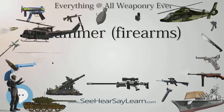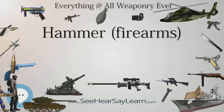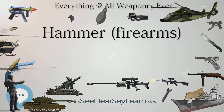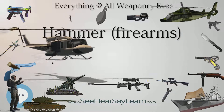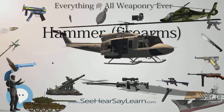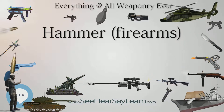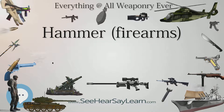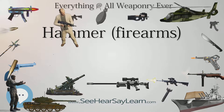The match lock system, introduced in the early 1400s, acted as an arm known as a serpentine that held the lit slow match. When the trigger was pulled, the arm would swing forward from its cocked state, similar to a hammer, via potential energy stored in a spring, and bring the lit slow match into contact with the gunpowder. The weapon could be utilized with increased accuracy, since the shooter could maintain both hands on the weapon.